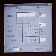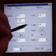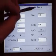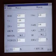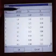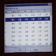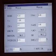You'll set your back gauge to wherever you will want it. In this case, I'm going to put 4 inches. The R-axis, which is an option on this machine and may not be on yours, you can put to where you want it to be. In this case, we'll use 0 because we're only going to be doing a single bend. You will select the appropriate punch, and you will select the appropriate die depending on the thickness of the metal that you're going to be bending. The V opening of your die should be 8 times the thickness of the metal, up to 5/16 of an inch. Anything 5/16 or higher should be 10 times the thickness of the metal.